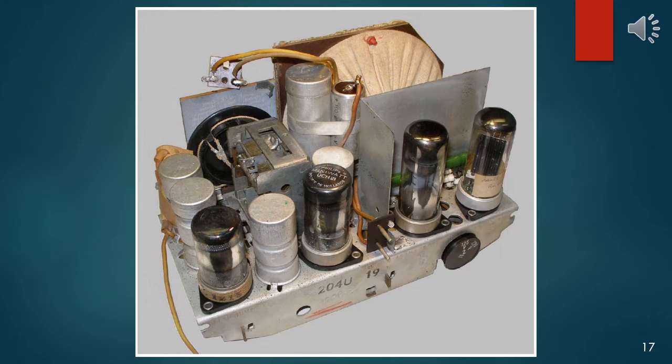This perspective view highlights the Swedish 2-pin mains disconnect requirement. The round plug mounted on the back of the chassis selects 125 or 220 volt mains use. Other dash number sets might include different mains voltage ranges, such as 150 volts as used in Hungary at the time.